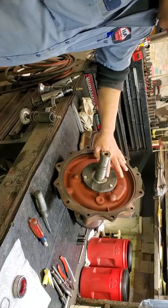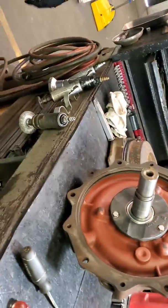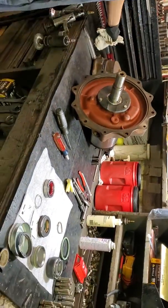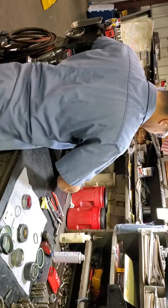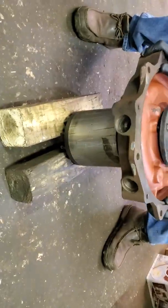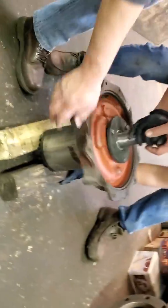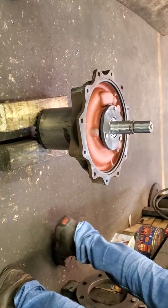When working like this with a dirty surface, we have to clean up the surface first before we install the outer seal. He likes to put it on the floor in a vertical position because it's easier to install the seal that way. Make sure everything spins freely, everything is good, then he cleans up the surface and installs the outer seal.